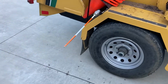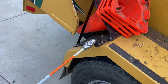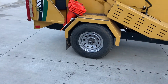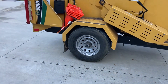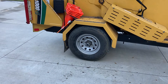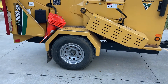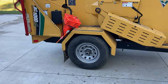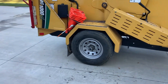Next, we did these spring-loaded markers. They serve a dual purpose. The spring-loaded design is great because the guys are always walking around the machine. The plastic tubing style doesn't last more than about three months — they bend and break off. These are actually made for a snow plow and they've worked really well. Secondly, for the driver — because you've got a narrow chipper on a wide-body truck — this allows him to see where his machine is as he's turning before it gets turned too tight, which is a great feature.